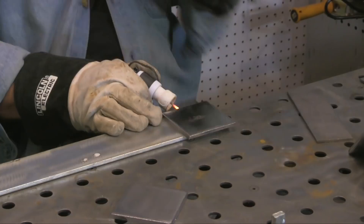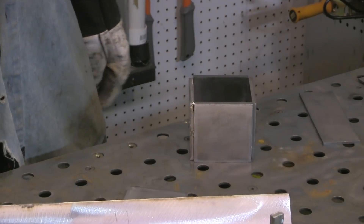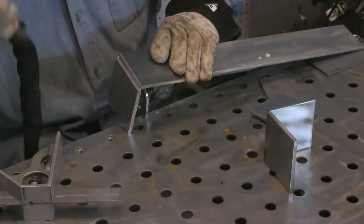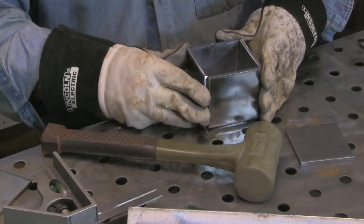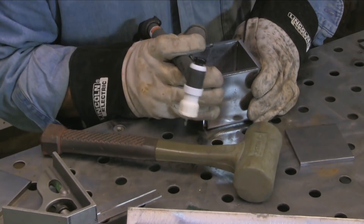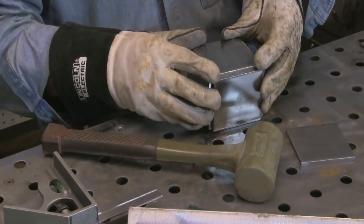Using a piece of aluminum angle to hold the pieces at a 90-degree angle. I got some tacks on there without even using filler, and it's going to come in handy for getting the extra piece on to turn this thing into a cube. I messed up — pulled one loose. Only had one tack on it. Now massaging it a little bit, making sure there's no gaps and everything is at 90 degrees. That's much better.